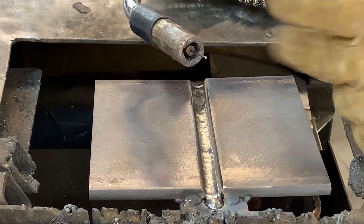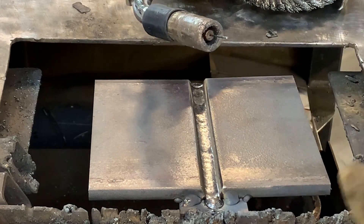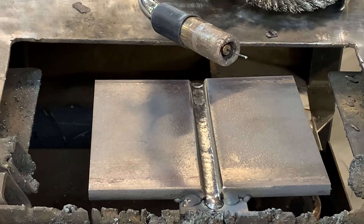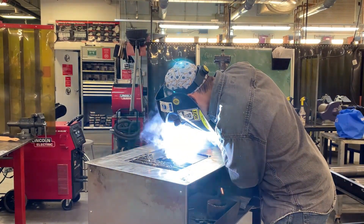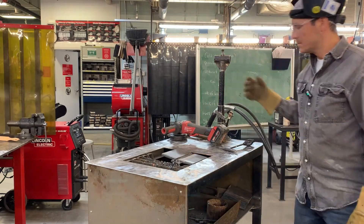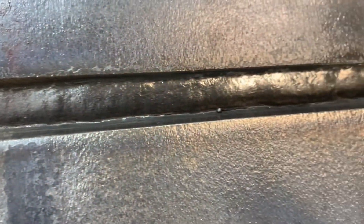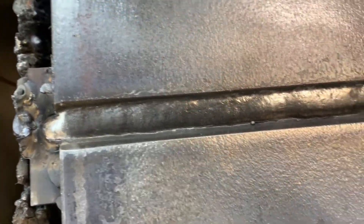My stick out is the distance from the end of the contact tip to the end of the wire. With spray transfer or flux core in these higher settings, I want to be between half inch and even up to three quarters of an inch. Once again, nice and clean — there's our second pass. Now I'm going to come in on this side wall and wash up and put my second fill pass in. We're doing stringer beads the whole way.